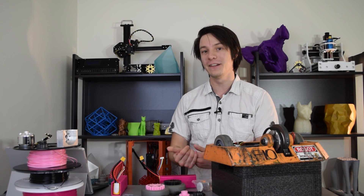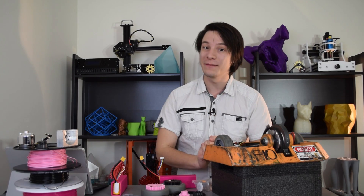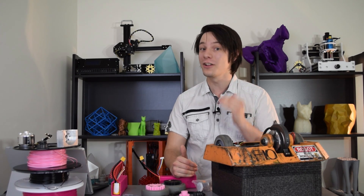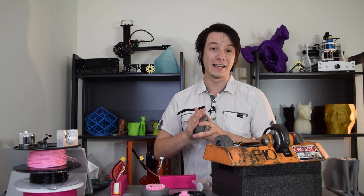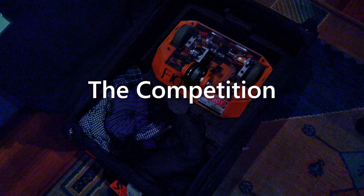All the PC Max parts were printed on my trusty Up Mini 2, which prints polycarbonates really well. Polycarbonate filaments are really challenging to print, so make sure you have a heated bed, an enclosed chamber to keep the heat in, and a hot end capable of printing at the 260-270°C you need. I couldn't be more happy with the part quality, especially printing a lot of these parts at 0.3 layer heights, near solid infill, and fast. I had to get them pumped out — including my spares — before I left for the competition. Here's a photo of the finished robot ready to go.